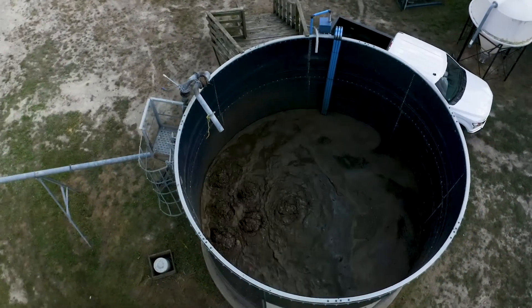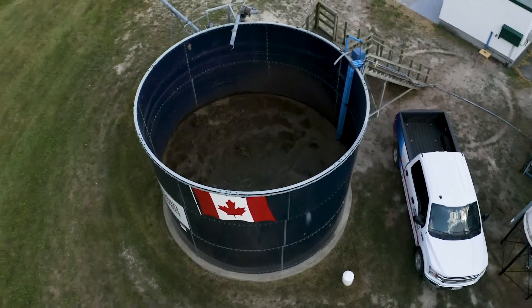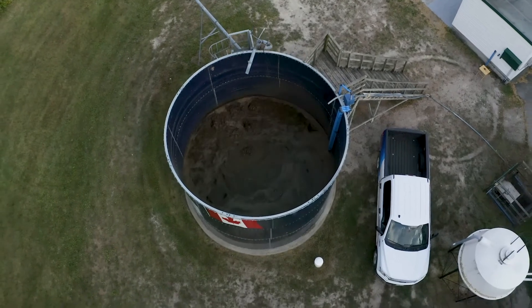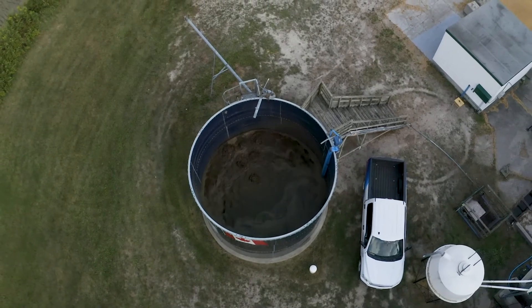We're actually reducing the amount of gases coming up off of that tank — a very noticeable reduction in ammonia, methane, and hydrogen sulfide gases, and other volatile organic compounds are just not there so much anymore in the manure. And then of course the nutrient benefits in the manure — the increase in the nitrogen values dramatically. The consistency of the manure means the top of the tank has the same nutrient values as the bottom of the tank. So you're not having to worry about covering the front of your field with really low nutrient value manure while the back of your field gets all the good stuff. It's completely consistent once it's spread onto the field.